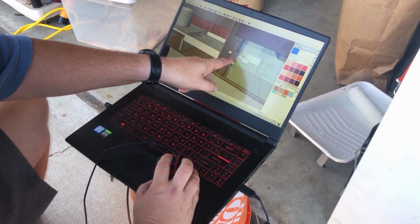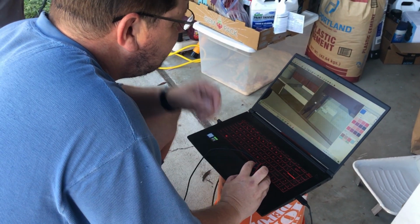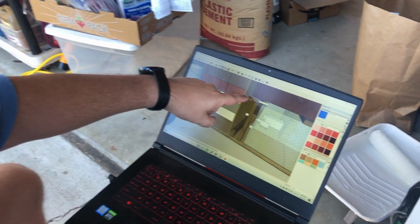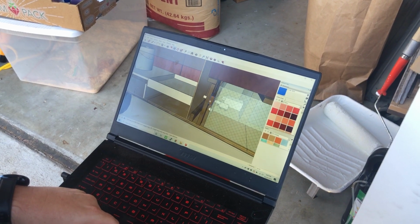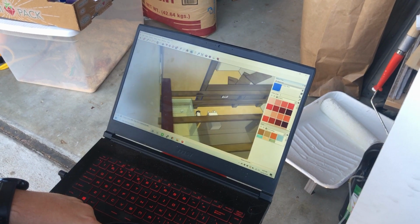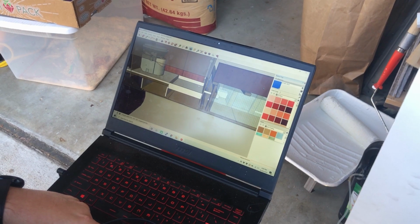We just put this 2x4 in, and now we're going to put these 4 vertical 2x4s, which are going to support this 2x4 on top of them, which is the first main support for the bed. And it's also structural support for the front wall, the front bedroom wall.